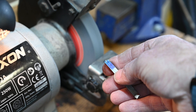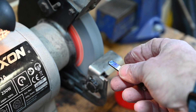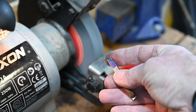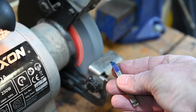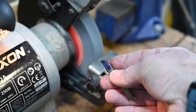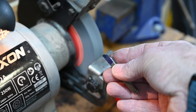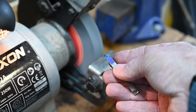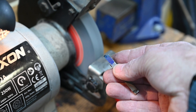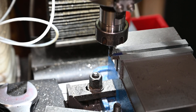As you can see, I've ground the corner down just on the corner of the grinder, got a little bit of relief on the right end edge and also on the top — I've raked it back. It's more or less to the line at the moment. What I'm going to do now is take it over to the mill, put a little 6mm cutter in the mill, and then just take the top edge off. I've got a carbide two-flute cutter in there and I'm just going to touch off on the edge.